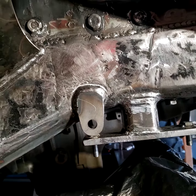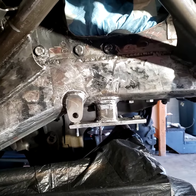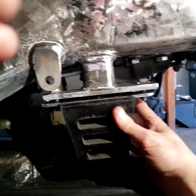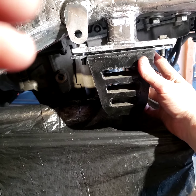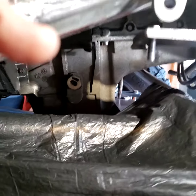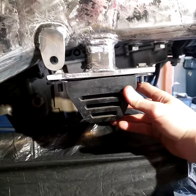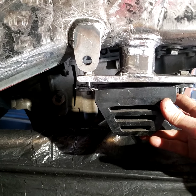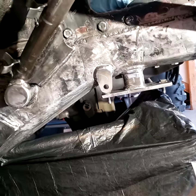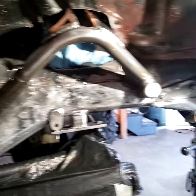This is the limiting strap tab and this is the bump stop mount, so you could have bump stop pads on your truss as well. These bump stops come from Amazon — cheap — in two different sizes. I think that one is a four or five inch; I'll try it and see how much up travel I get, making sure I'm protecting the oil pan. I have a shorter one too, and I'll figure out which works best on the trail. You don't need fancy $350 bump stops for a trail rig — rubber bump stops work fine.